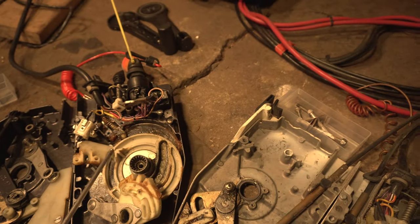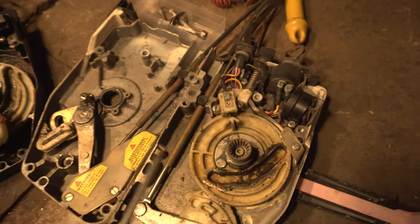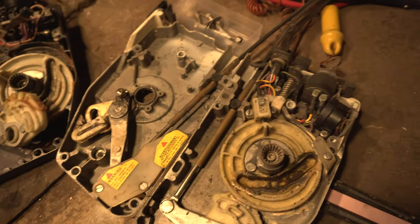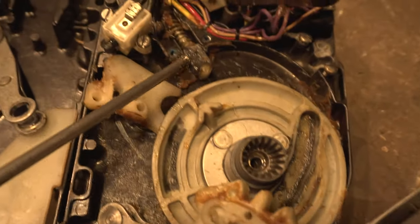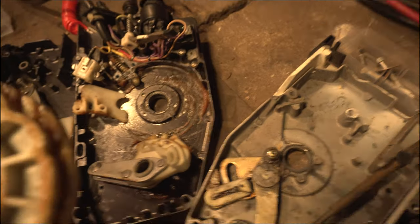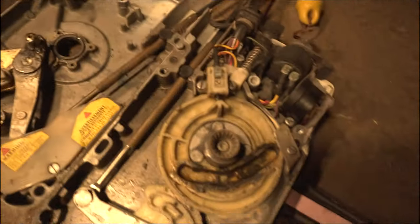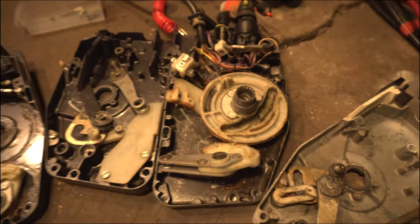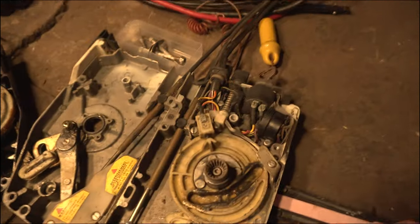I haven't fully fixed this yet, as I'm not exactly sure what caused it to be out of place. To keep the arrow in position, below the button there's a little contraption — basically a little spring with a ball on the end. At the bottom of the assembly there's a little groove where this ball fits, so when it goes into place it becomes perfectly aligned. I did notice the ball on this one was in poor shape, and that's possibly what's keeping it out of place. I'll update exactly what I did once I fix it.